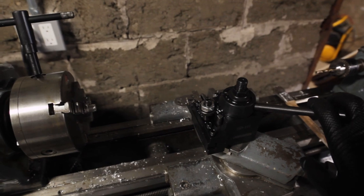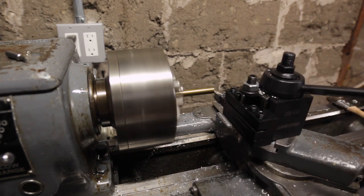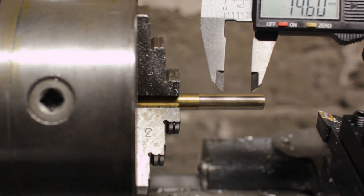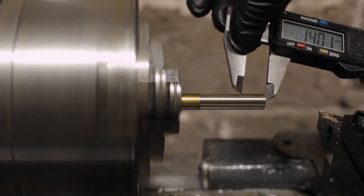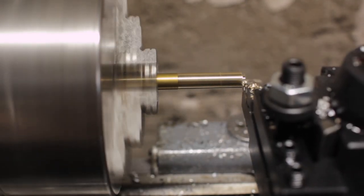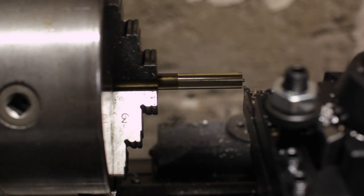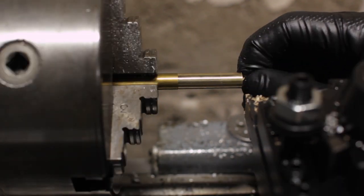What I'm going to do is mark some lines on this with my calipers — find the distance and then just scratch them in. Since I'm cutting sharp corners, I'm just going to use the cutoff tool to make the cuts. I'll keep checking with the actual insert to see if it'll fit on there. We still have a little bit to go — going for really nice fitment.